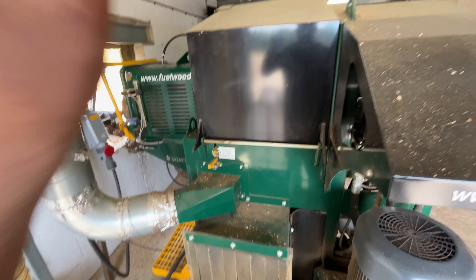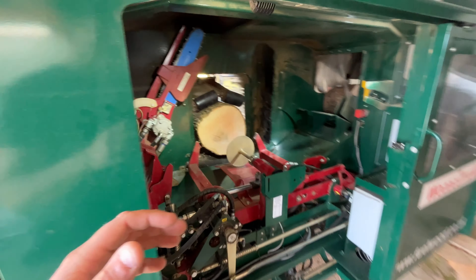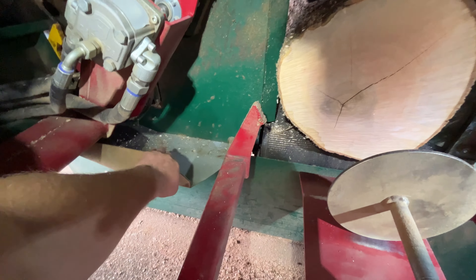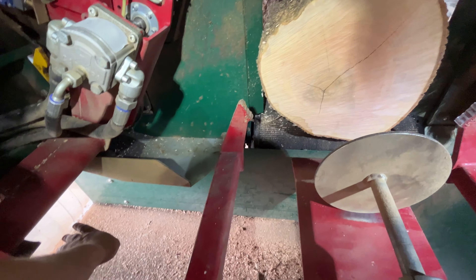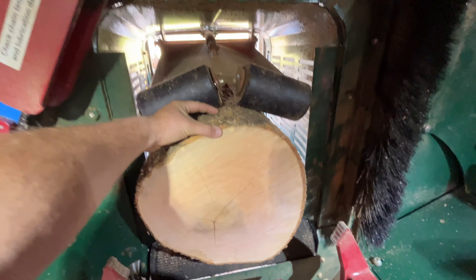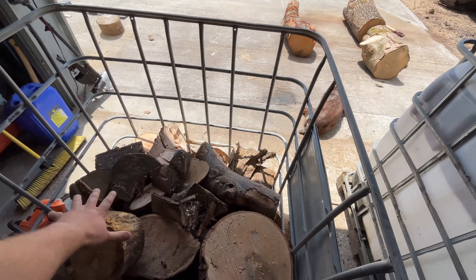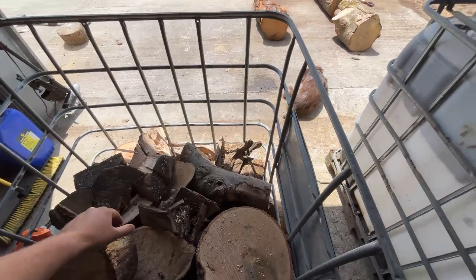As I walk around to get to the saw motor, I'll explain what this all is. The debris that drops off a log - majority of the sawdust goes up here into the sawdust extraction system, but if it drops down it comes out on the belt. Any bark that falls off, and when you get to a thin ring and this arm lifts up to dispose of it, it drops down onto the belt and gets rid of it - that's where the bin is. All these off-cuts and bits go through the eco Angus boiler and create heat for the kiln, so nothing goes to waste.